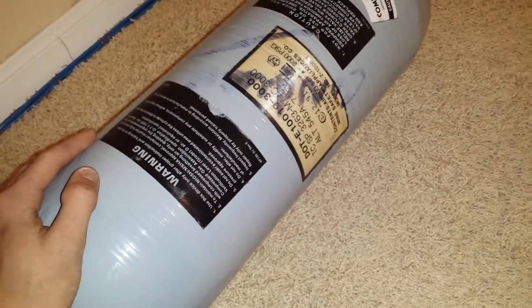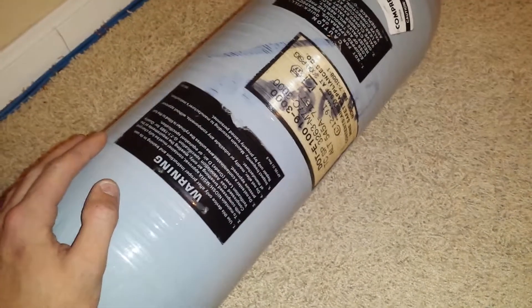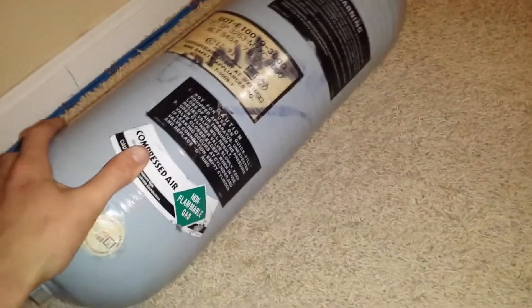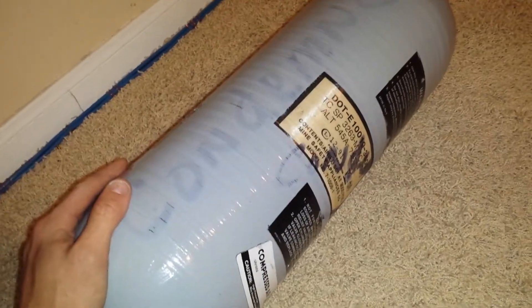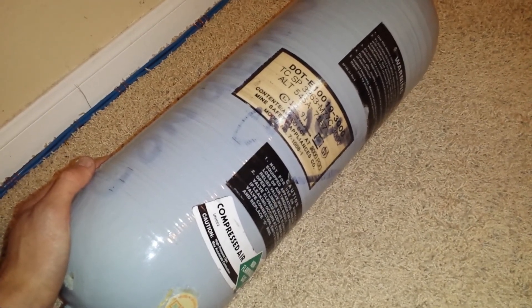And that's all thanks to hydro testing. In my opinion, if you're going to get an SCBA kit, go with an aluminum tank. It's going to be heavier, but in the long run you're going to be much more happy with the performance and reliability. Five years versus three years for hydro — and hydro's not cheap. For me it was $25, not bad. Anyway, that's it — figured I'd show you what it looked like and the process. This is KG5IWQ, 73.